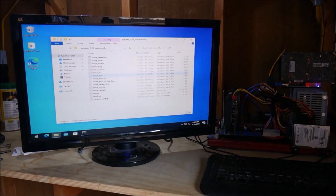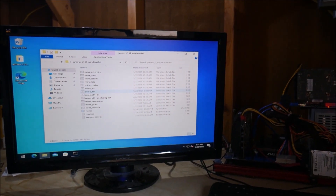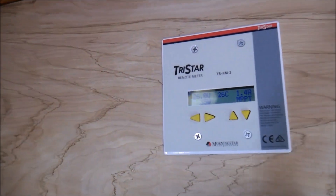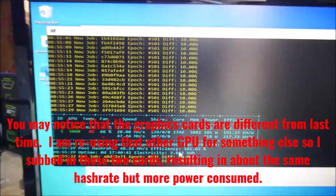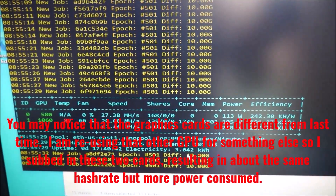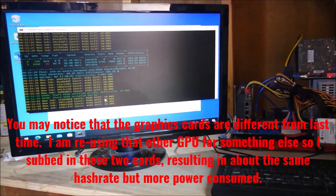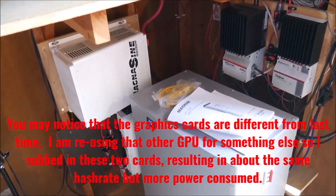I think we have success here. As you can see, it's about 9 a.m. — this is about when the system would fail in the past; the crypto mining rig would stop working because the battery would stop working. As you can see, we're still at a pretty good voltage: 26, 25.9 in that range. The Millertechs definitely did the trick and added that extra capacity. This is a very low-end mining rig, and that's fine. This is not to show you how to set up a professional system or anything like that — it's just to illustrate what all would be required to power this with solar.